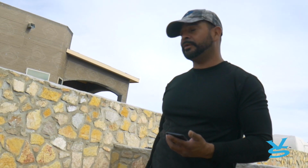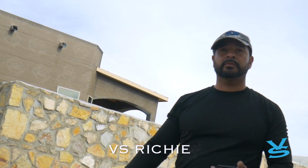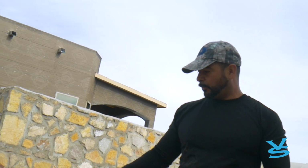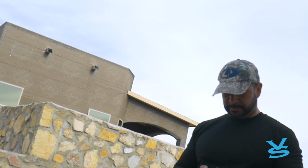Because of, see the board? Mm-hmm. When we screed it, it's going to be low. Mm-hmm. When it's level, it'll just move right on top of it. You're not going to have no dips, or if it's high, the board will knock it down. Mm. So right now we're pretty much at level. We just got to double check on the pattern.